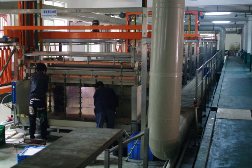Cleanliness is essential to successful electroplating, since molecular layers of oil can prevent adhesion of the coating. ASTM B322 is a standard guide for cleaning metals prior to electroplating. Cleaning includes solvent cleaning, hot alkaline detergent cleaning, electrocleaning, and acid treatment.